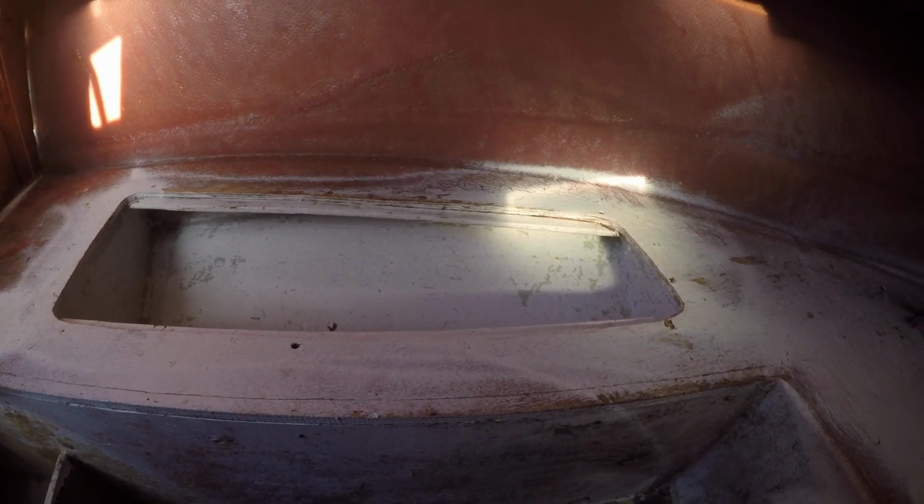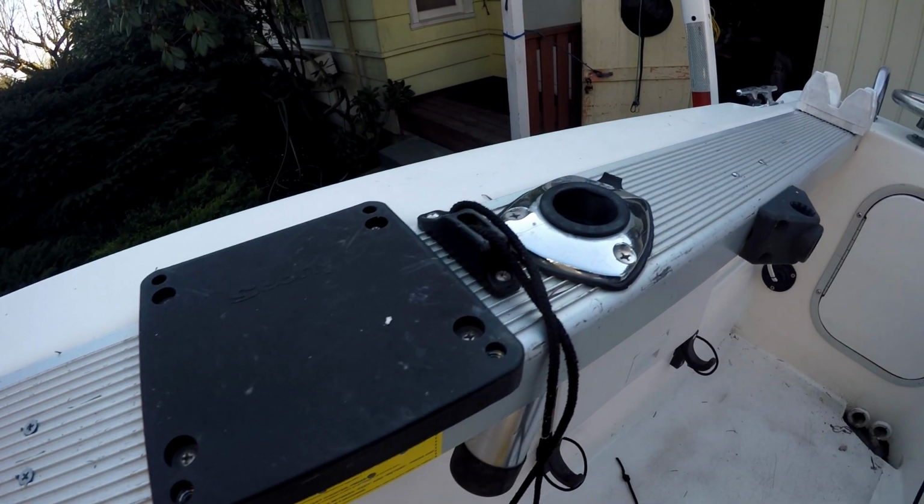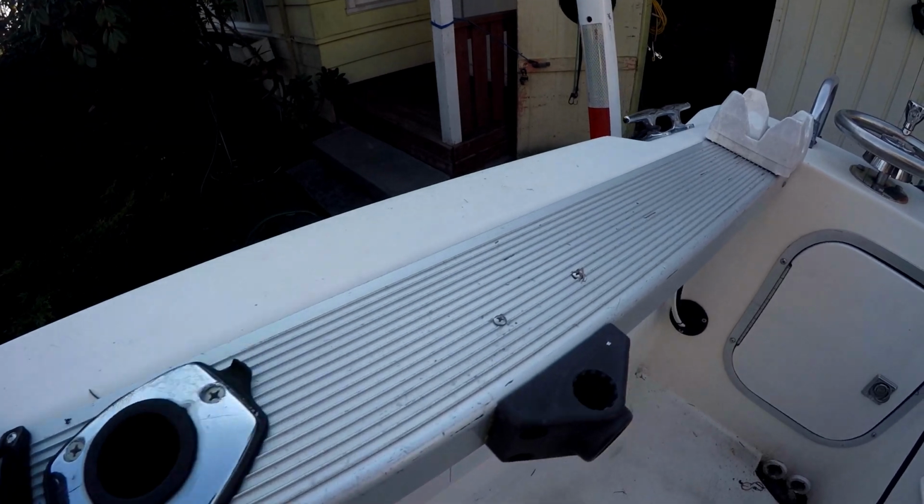I want non-skid on the deck, steps, storage lids, and floor in the cabin. Eventually, the top edge of the gunnels. Non-skid in gel coat uses a flexible mold, is best for small repairs, and is very expensive. Sprinkle on textures and paint are hit and miss, but soft sand rubber responds well, is much cheaper, and is suitable for the different places needing non-skid.